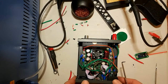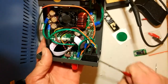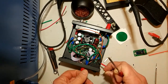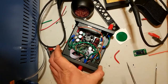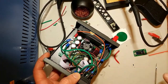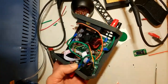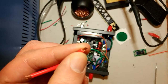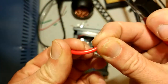That's part of the problem. The soldering joints are two little solder pads going right to the switch — and to solder this fat wire onto a pad and then bend it onto the switch and then solder it there and do the second one is extremely frustrating. So what I ended up doing was throwing out all the wire they provided and using my own 12 gauge stranded THWN. Now, THWN is not the normal stuff used for DC things — you normally use it for household wiring — but at least it is stranded, so it is flexible, and it is 12 gauge, so it can take up to 20 amps. It's much easier to work with because it bends more freely.